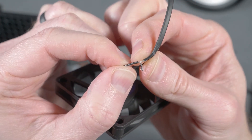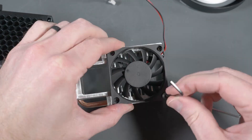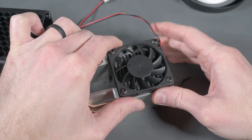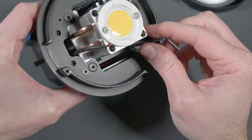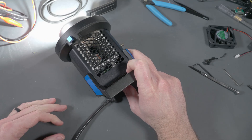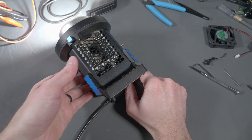Even the connector they soldered on is a little bit weird, which we'll look at later — so stick around to see why it's a big deal. I went ahead and put on the 60 by 10 millimeter replacement fan. Of course it fits perfectly since it's the same size. I tightened it down with the same hardware, slapped the light back together — and the light functions properly, but the fan is not spinning. What is going on?